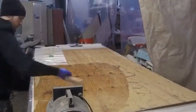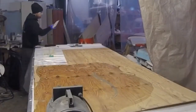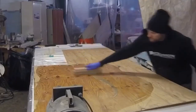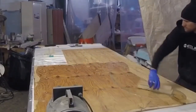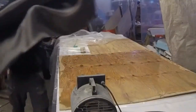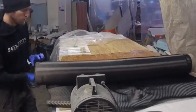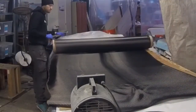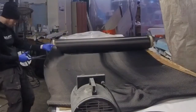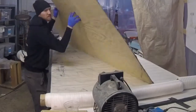We had to make this huge change, which took away the whole space set on the passenger side of the aircraft, because we really needed to find a way to get that weight forward. The battery pack is heavier than the generator and sits a little further back in the fuselage, so the aircraft was tail heavy. With that heavy battery pack it just turned out to be too much.